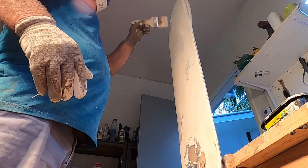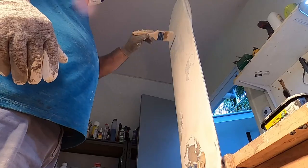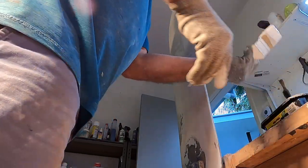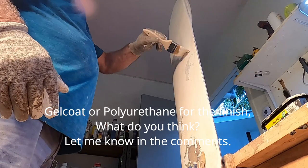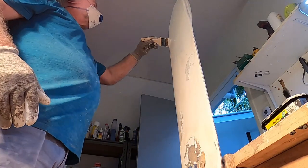My aim is to finish this with 2-pack polyurethane because in my experience I can get a better finish that way and it's more flexible and more resilient. Gel coat or flow coat is actually quite brittle and chips quite easily, whereas the 2-pack polyurethane will give a really robust finish.